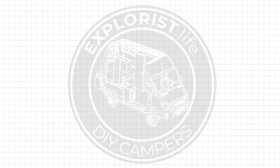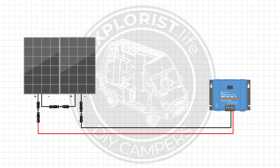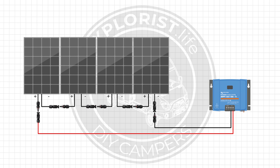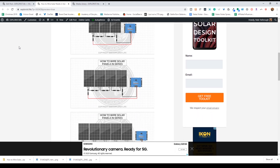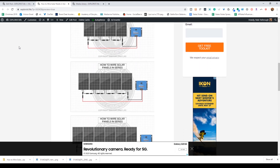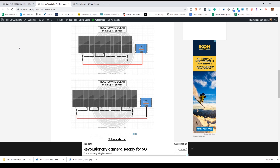The process of wiring all this together is the exact same regardless of if you're using two panels or ten panels — positive wires to negative wires for each of the neighboring panels, and then the positive and negative wires on each end go to feed the charge controller. I'm going to put some pictures of multiple solar panel series wired configurations in the blog post for this video so you can use them for reference, and I'll link to that in the description.